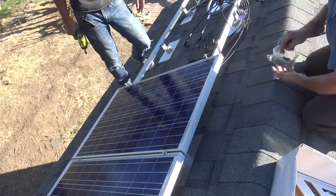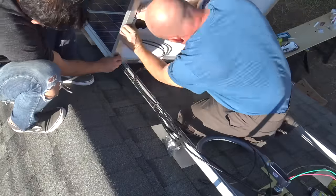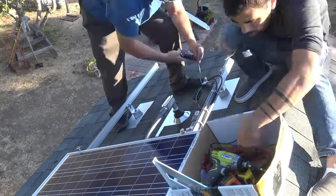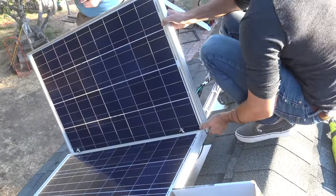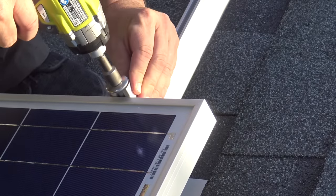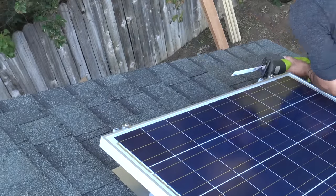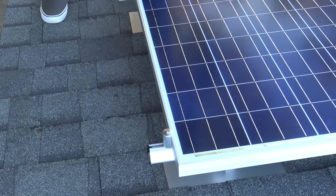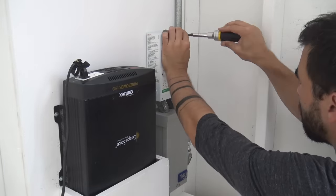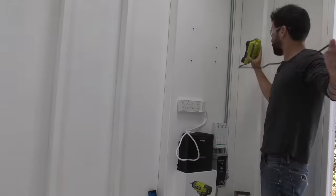The railing system came with these bolts that slide on either side of the panels. When you screw them down they have a large washer that clamps onto the aluminum rails of the solar panels. We secured the panels one at a time making sure to keep the wires tucked up underneath them. After connecting all the wires and installing the last panel, we used a reciprocating saw to trim the rails and then plugged in the little end caps. I blew the dust off of all the panels, closed up all the electrical boxes, and was ready to test out our system. The inverter only has two plugs and we're going to need a lot more than that, so I attached a power strip to it.